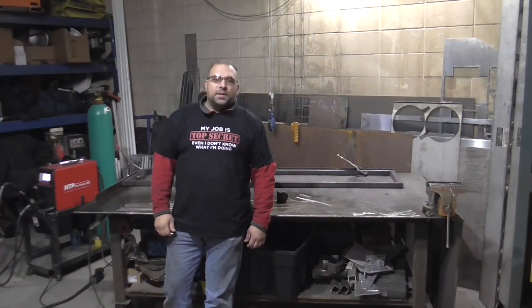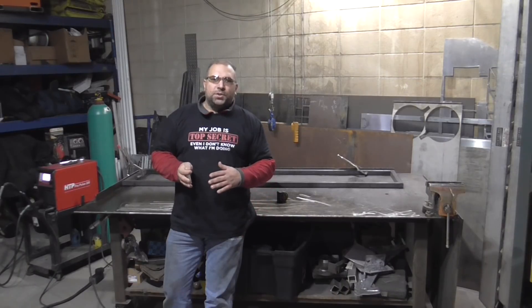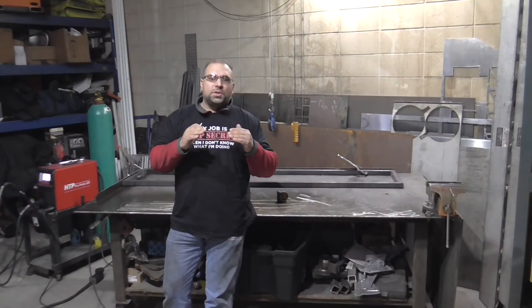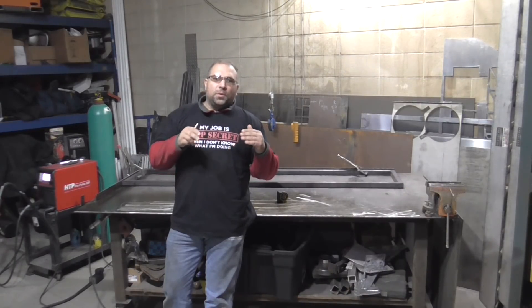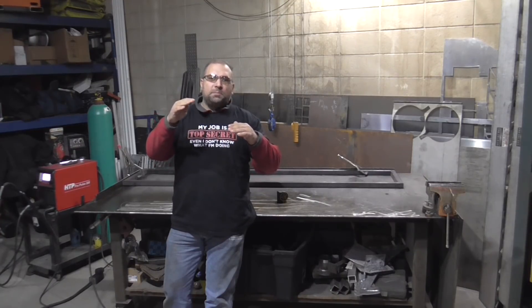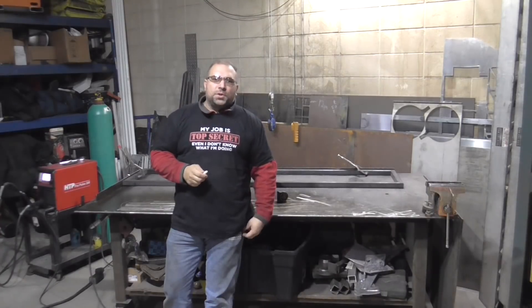Today's topic is synergic settings. There are machines on the market that tell you a material thickness rather than an amperage, wire feed rate, or voltage. What synergic means is that the wire feed rate and voltage on the MIG machine need to be balanced — a low wire speed matches a low voltage, a high wire speed matches a high voltage, and anywhere in between. That's what they call a synergic curve.